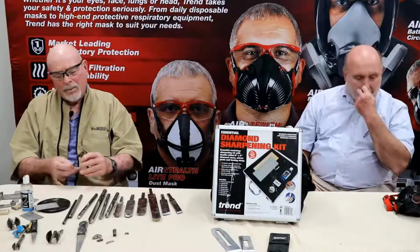So I'm sitting there thinking, somewhere in the back of my mind, somebody kept telling me that when you're sharpening, if you can keep the flats flat and just keep working on the flats, saw blades, chisels, whatever, you want to work that flat. And I looked at the Forstner bits and I said, well, the teeth are actually flat. On these original Forstner bits, they have a flat surface because you really can't do anything with the profile. So you have to sharpen the tooth some way, and it has a flat on it. And the cutting surface itself is a flat.